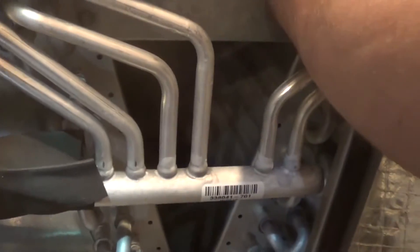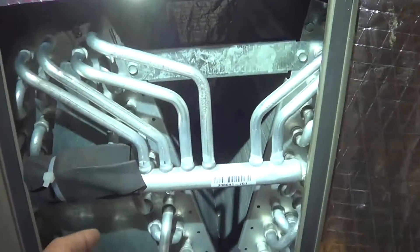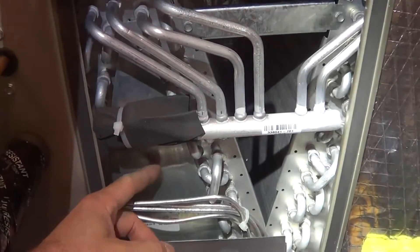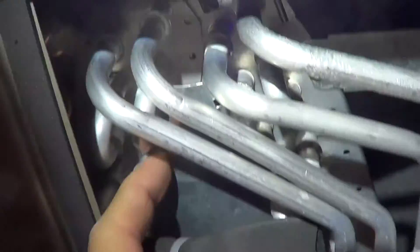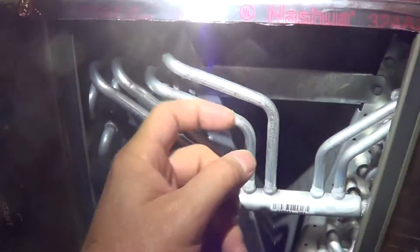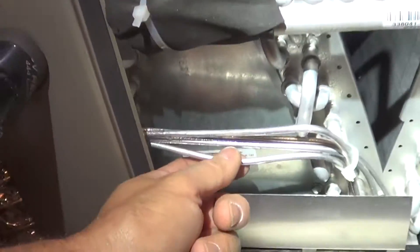So that coil is going to be full, and I've got a little bit of superheat on the right coil — I'm feeling it with my hand. The first thing you want to do when you have a circuit imbalance is just make sure there's not an instruction manual blocking one of the coils. You can pop off the plate, look inside — the coil is clear. So what I'm going to do is manually balance this coil, because I've got just one coil overfeeding, and it's this tube right here.